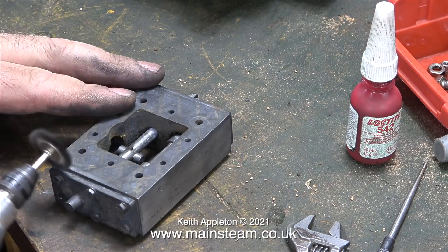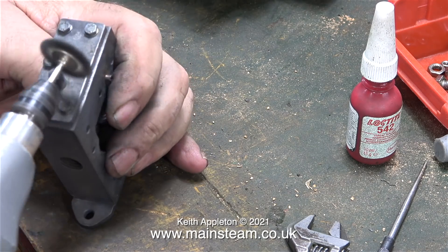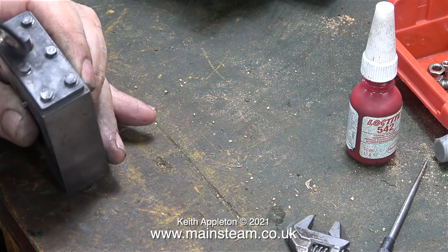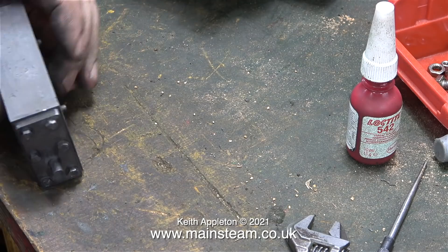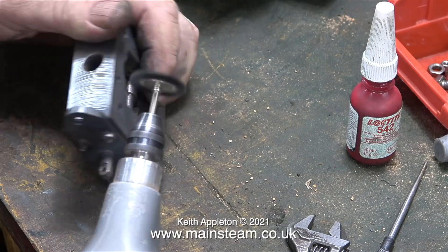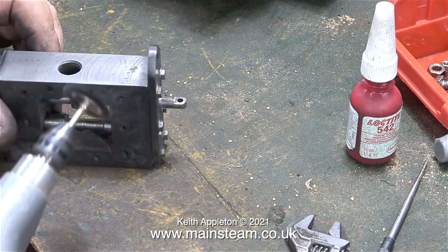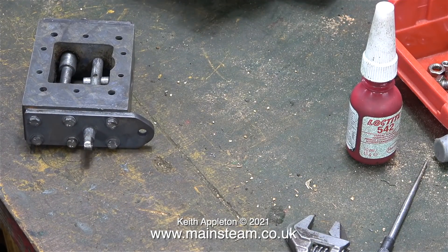To get into the more inaccessible areas I used a small wire brush in my Proxxon motor tool, and I was wearing eye protection — you must always wear eye protection when using these wire brushes. I mentioned previously about not putting parts into the tumbler that had steamways. I certainly didn't put the cylinder into the ultrasonic cleaner, but this one is OK because if the ports block up I can actually get to them very easily by removing the two top covers. And that's it for this episode — stay healthy, thanks for watching, and I hope you found it useful.